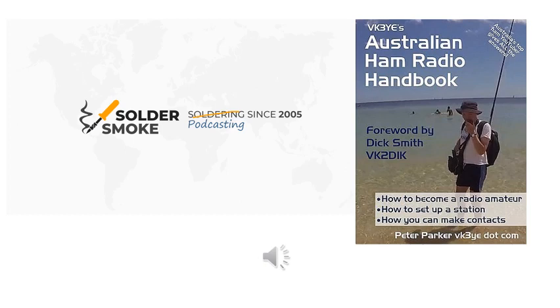Many beginner books on QRP compare QRP with high power. 5 watts compared with 100 watts is a loss of 13 dB — so an S9 signal drops down to S7 with QRP, and it should still be readable provided there's not too much noise. But one thing they don't always tell you is the behaviour of signals under different receiving conditions. You can hardly hear a 3 dB drop on signals well above the noise, but if the signal is competing against the noise, then 3 dB is a big difference. With 90% of stations that can hear you with 100 watts, drop down to 10 watts and maybe 70% will still hear, but down at one watt only 20% might — you're near the noise level. Losses and efficiency are really important at low power levels.